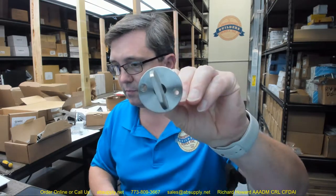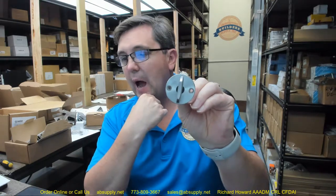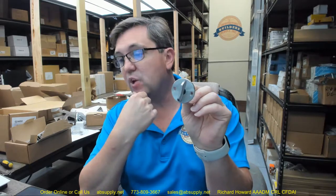You need to decide whether you're doing sectional trim or escutcheon trim. I like that low-profile rose a lot — I think that's the one we sell the most of. If you're upgrading or changing a lock, you might need to consider escutcheon trim, because it can assist in covering up old holes that won't be utilized when you install a new lock body. They also have optional thumb turns: standard, one with concealed fasteners, and an ADA-compliant thumb turn — be mindful of that for commercial bathroom applications.